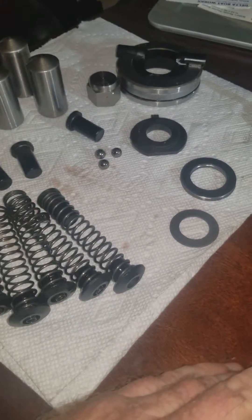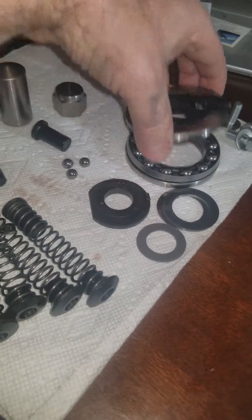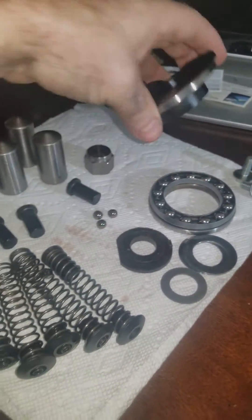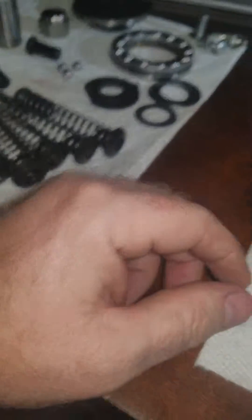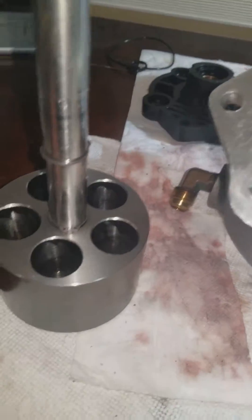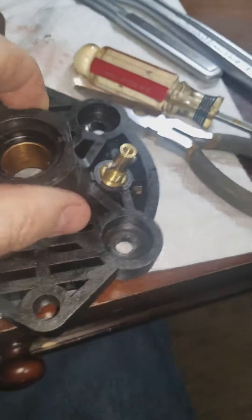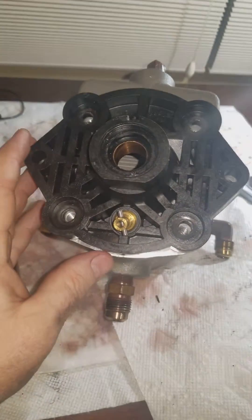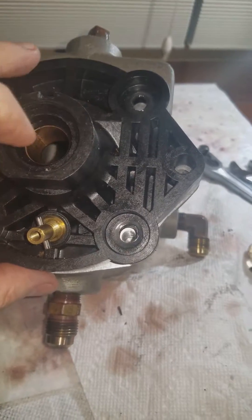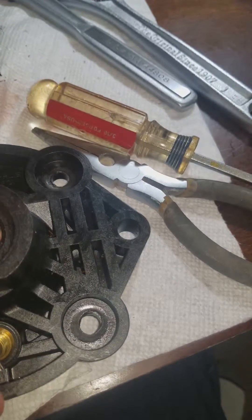As for wear parts, I haven't found many issues — most of the stuff has survived in pretty good condition and this unit is quite old. The bearings are really good. Really what it comes down to is making sure it's not leaking, which is probably why most of you have taken yours apart. Two of the leak points are found here in the front — this is where the main shaft comes out, and a nice big thick seal goes right in here.